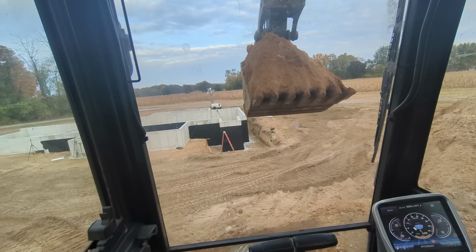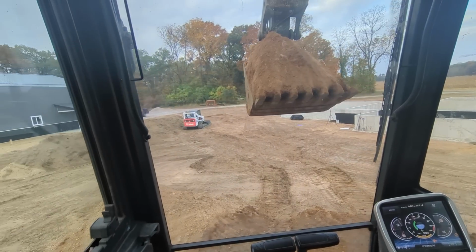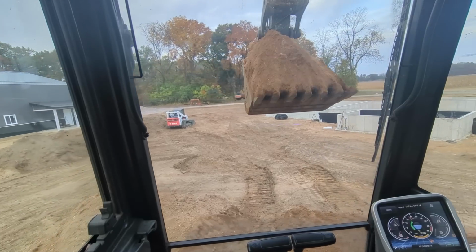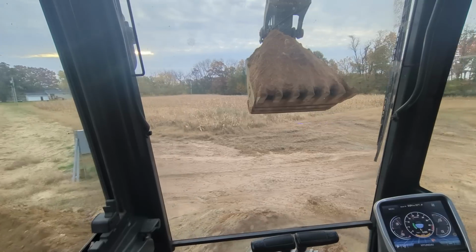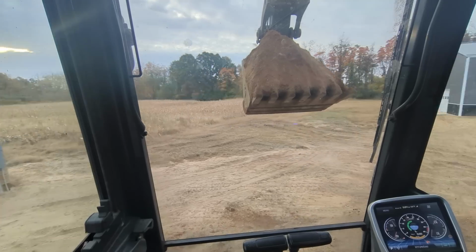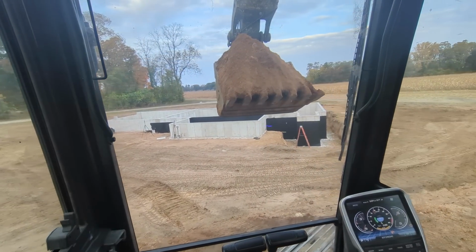So we're going to get the dump truck, and we're going to take some fill dirt around to various spots around the basement, and we'll start the backfill process. I was going to haul in fill for this part and just grade this off to bring up the area around the house, but I need to get this out of the way because as soon as we possibly can, we're going to trench across and get the electric put in the house, and the whole end of this pile is in the way of the H panel right there, so I need to at least get rid of this end of this pile so it's out of the way. So we'll go ahead and just use some of this, and then the rest of it we'll get from out back from our borrow pit that we've already started. So alright, let's get started.